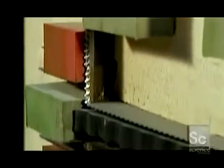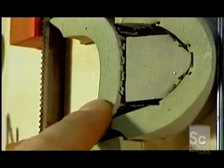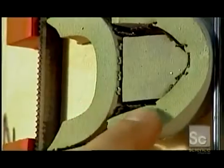First, the trimmer perforates the boards to create flaps and handles. Rubber sponges cushion the blades so that they cut only the parts they're supposed to. During the trimming, a press condenses the box's overlapping panels to level out their thickness. Workers usually cut the sponges by hand to make sure they fit snugly around the blades. The trimmer runs at a speed of 5 miles an hour, processing up to 90 boxes per minute.